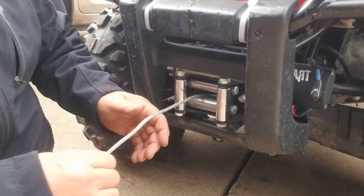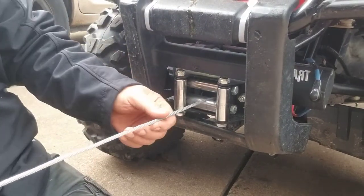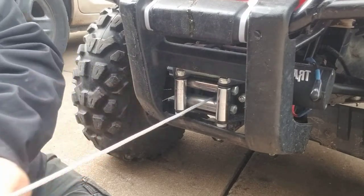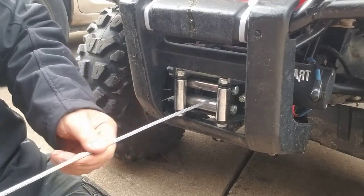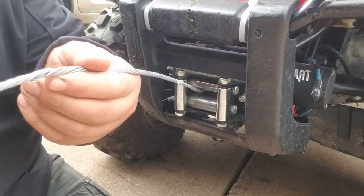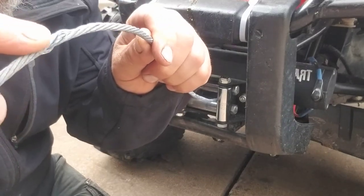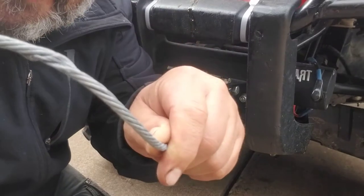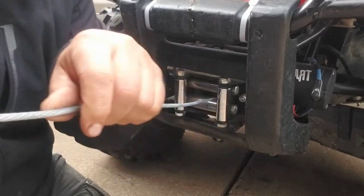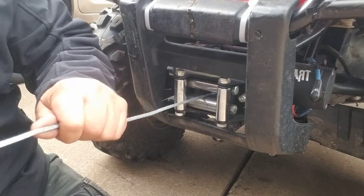What we're going to do now is pull this old cable out. We've set the winch on freewheel. Now I haven't used it that many times, but this is what this cable does — it winds up cranking and binding on itself, and it actually damages the cable. It's kind of like a little mini bird cage, and if you know anything about cables, that's not good.